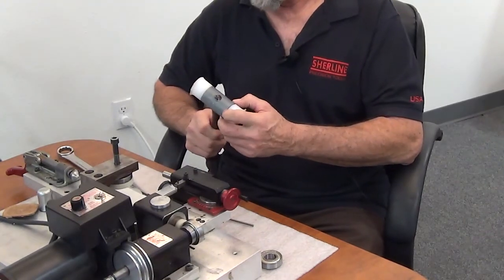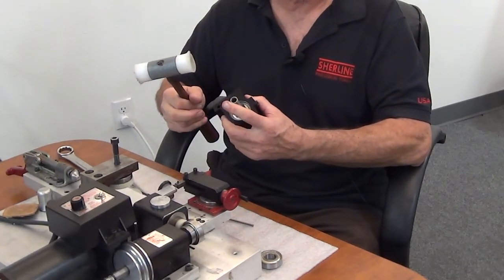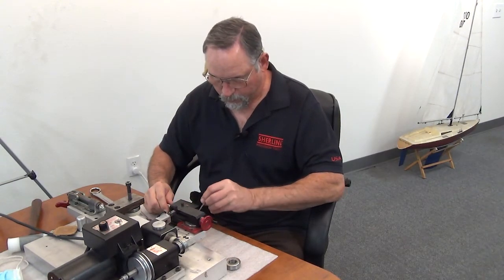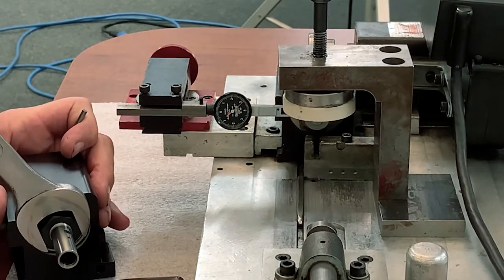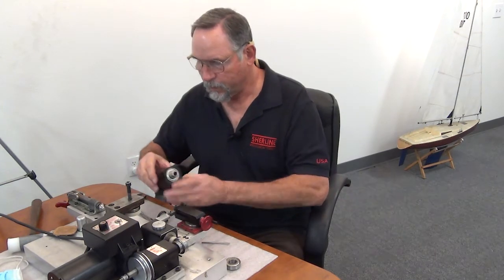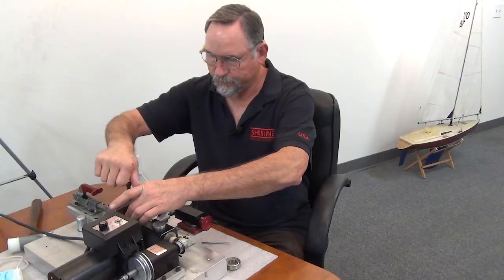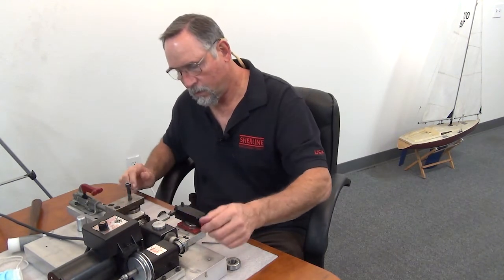Then you get a plastic mallet — or a steel mallet with a wood block here, because if you hit this with steel you'll obliterate the back of your spindle. So we use a plastic head mallet and give it a good sharp wrap, and now this spindle is loose again. Then you put it in and tighten it down to roughly where I'd say right about there, and now we'll check the indicator again to see what the difference is.